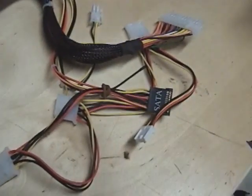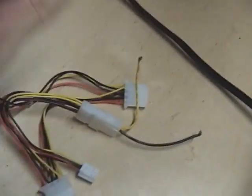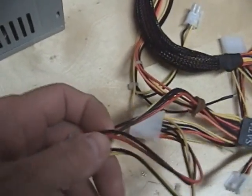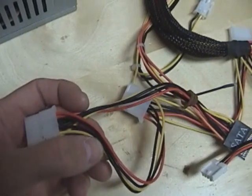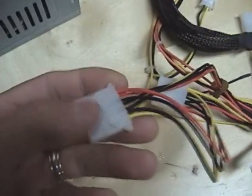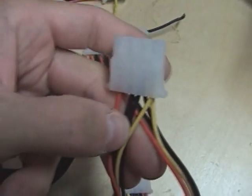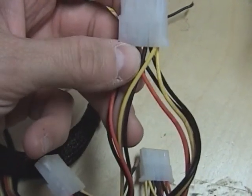All these leads are live now, so you have to be careful about shorts — I should tape these up. The leads I'm focused on are these two: any yellow wire on this power supply is a 12 volt rail. Things going to hard drives have a 12 volt rail, two blacks in the middle, and a red which is the 5 volt rail. We don't need 5 volts — we only care about the 12 volts. So I've taken one of these Molex leads and, with the power supply off, yanked the yellow wire out of the connector, then yanked one of the black negative wires out as well.